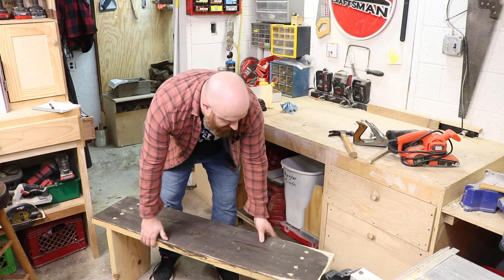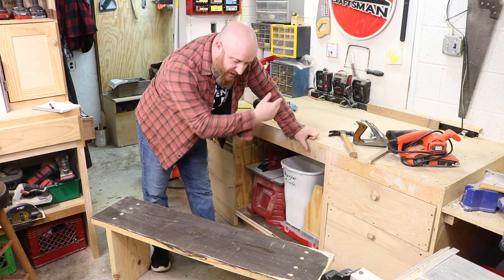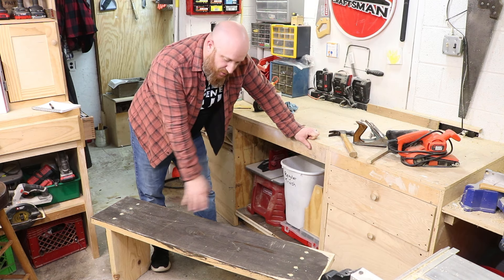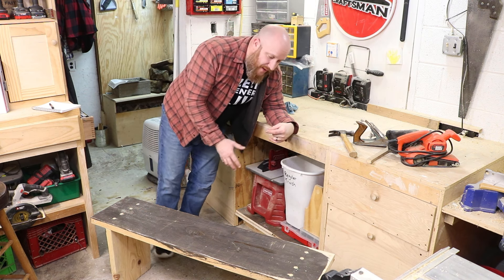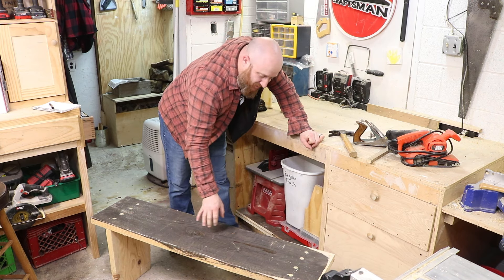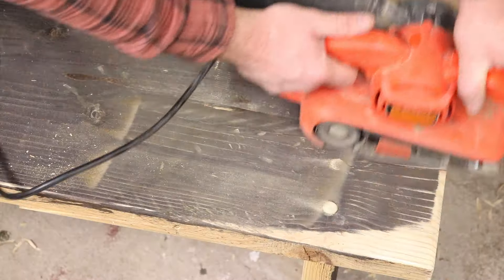What I'm going to do now — which is not a step you'll have to do — is remove an old stain I don't want, using a hand sander. But in the process I do want to get this as smooth as possible, because an old piece of wood is going to be smooth, not rough and beat up. So I'm going to start with 60 grit, then go up to 100 grit and try to make it as smooth as I can.